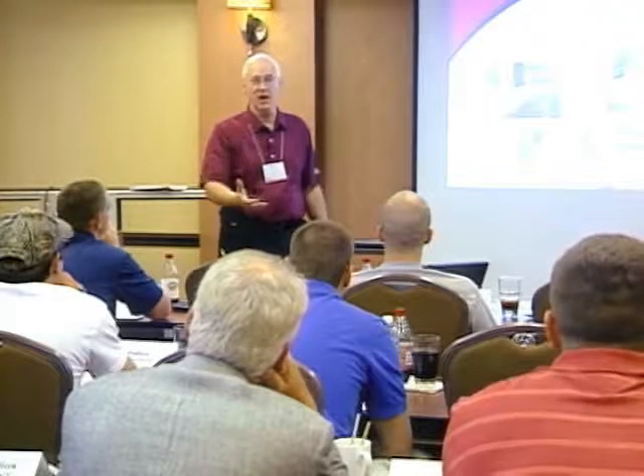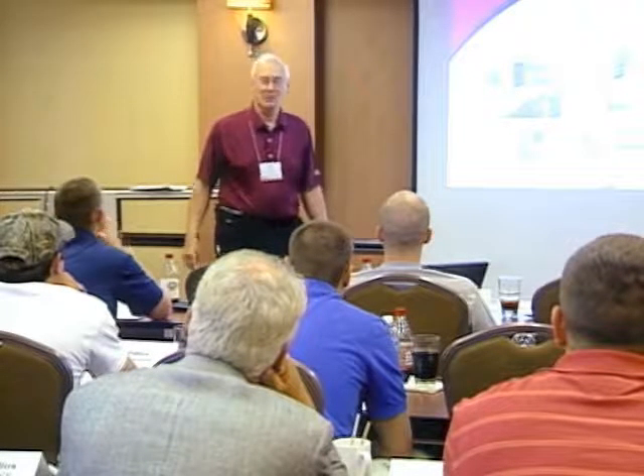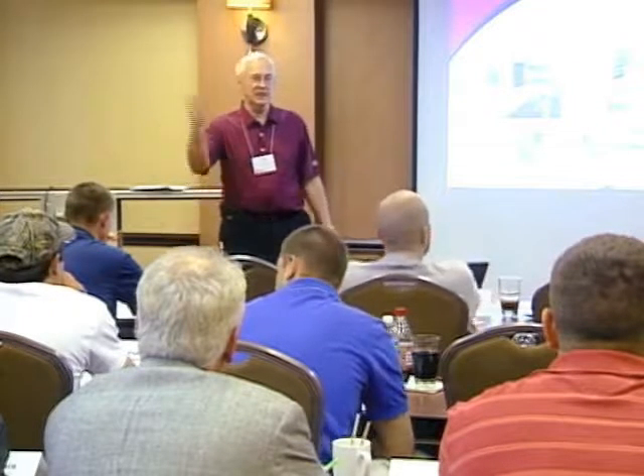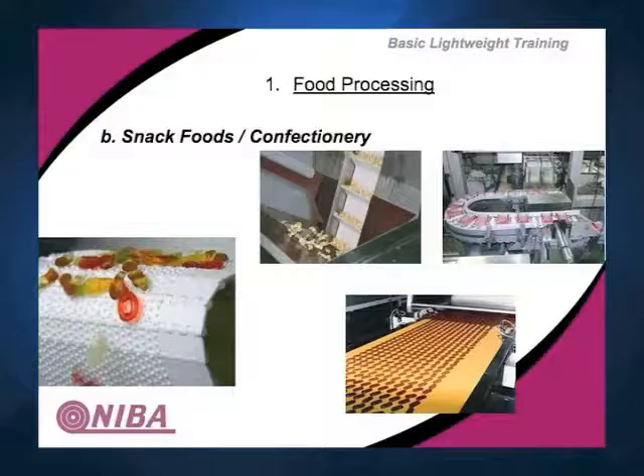There are often scrapers in bakeries to get dough off the belt. Release is important. Are they filling the dough with any sticky substances? The biggest issue is buildup on rollers because they're working with dough and can't stop to clean it — it causes tracking and training issues. The belt can be tracked but won't be trained anymore once buildup occurs, and sometimes it's only on one side of the pulley. The scrapers, if the pressure isn't equal across the entire width, it will influence the belt and push it around.